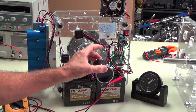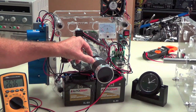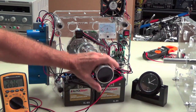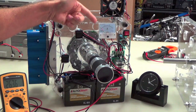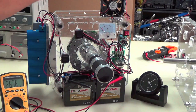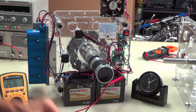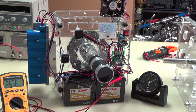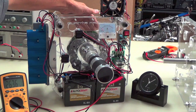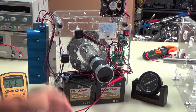And so you've got heat, you've got friction. Up ahead of that is the gear head section, so lots of friction there too. So, you know, this is a real power consumer here. Inside we've got the front main bearing with friction, and then back here the rear bearing also with friction. And aside from that, we've got plenty of Lenz's law counter torque going on in the three-phase axial flux alternator, so you've got that to consider.